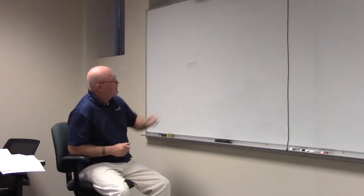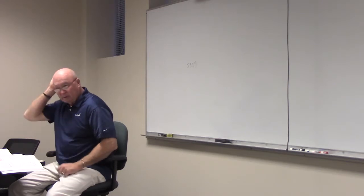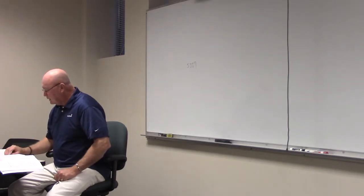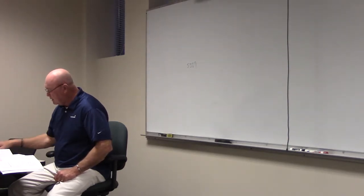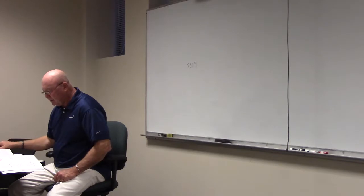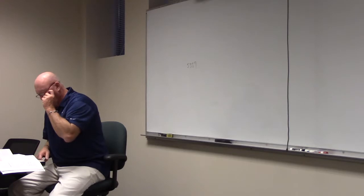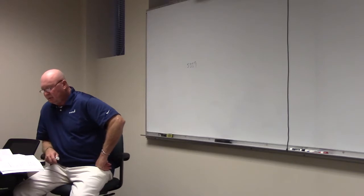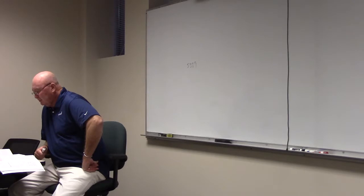That's step one and two, I guess. Okay. Easy enough? Step three, you gotta do the range. We gotta do the range to, where we going? 220.55, and it said there was how much? Was the range 8.75, so we may be in a different column. What column are we going to use for an 8.75 kW range? Yeah. Column B. Column B, good.